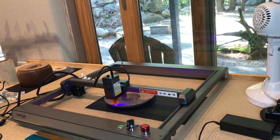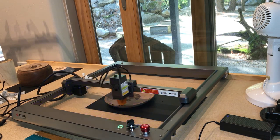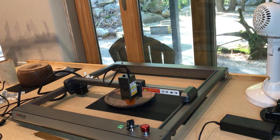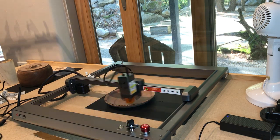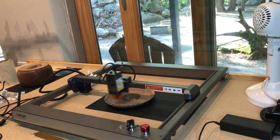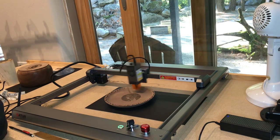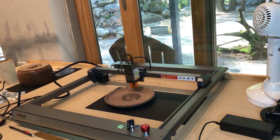One of the other projects I was really excited to try with a laser engraver is to put a design around the rim of a bowl. Y'all know I don't always start with the easiest projects, and this is no different. The width of this rim is only about 10 millimeters, so I didn't have a whole lot of space to play with. I made a circle design in Inkscape with stars and little solid circles of varying sizes. I used a piece of black matboard underneath the bowl for a test piece, and it looked like it was going to line up perfectly — and it's darn close. Ideally I would have made the design a little bit smaller for more buffer around the rim, but overall I'm really happy with how the border came out, and I see a lot of possibilities for this technique.